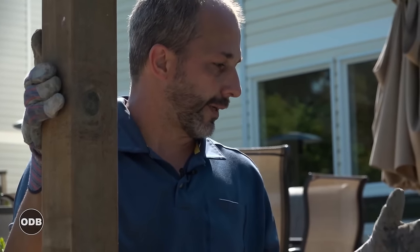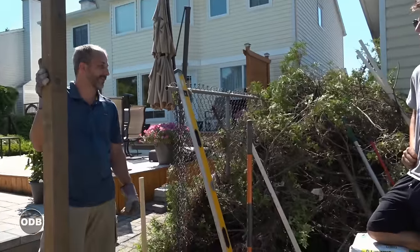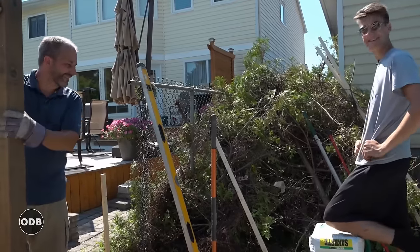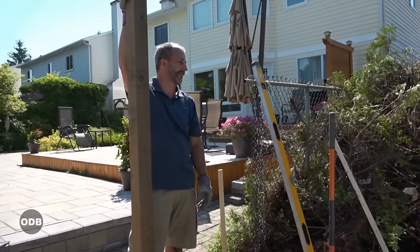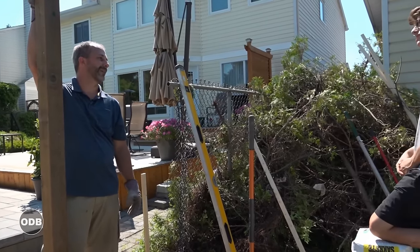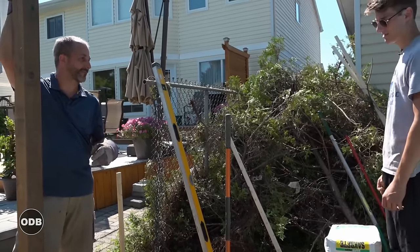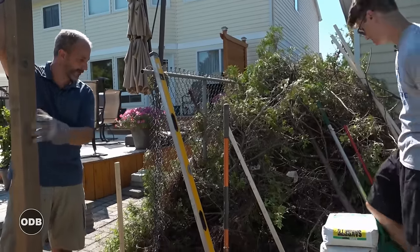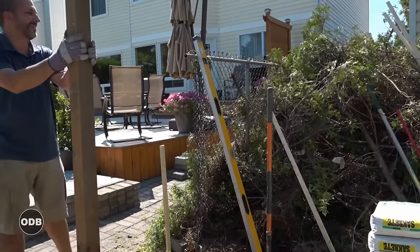Quick skill-testing question on the bag, Nate — does it say 'good for four-season climate'? No, it does not say that. All it gives is an instruction: two bags per hole and put your hole at 48 inches to use two bags of concrete. This is the only case in my entire life where it says to read the instructions and the instructions are wrong — because that's for most soil conditions and most climates, what they call a standard installation. Because our ground freezes, we're no longer a standard installation. So we're going to go with one bag.